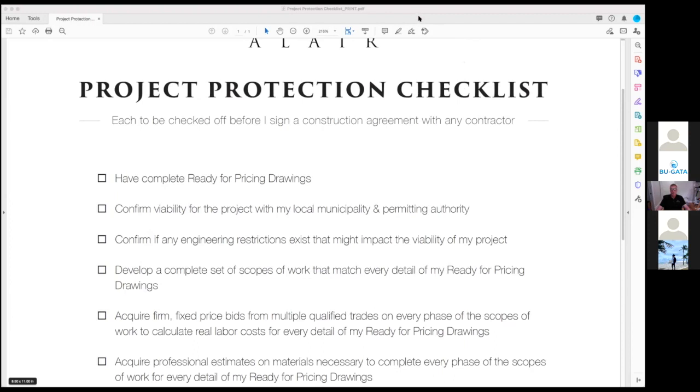there's setbacks. Now, most of you are living in houses that have a zoning requirement of R5 or R6 for most of the houses we have here in Arlington. If you have R5 or R6, that means that you have to have an aggregate width of 18 feet on your property. So if you have a 50-foot wide property or a 60-foot wide property or whatever that is, you subtract 18 feet from that. If it's 55, you have 32 feet with which to work.